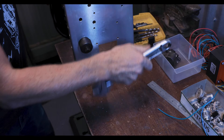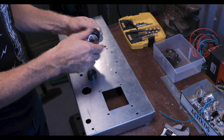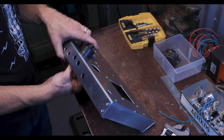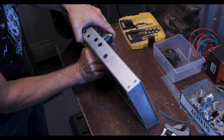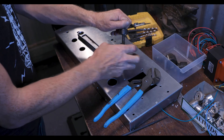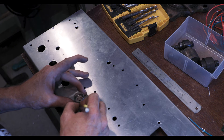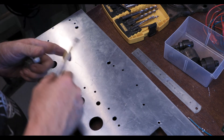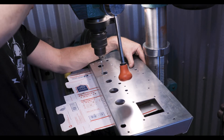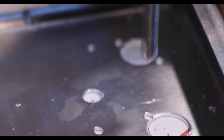I'll do my Greenlee chassis punches and punch out all those holes. I've got one for the preamp tubes, one for the power tubes, and one for the pilot light. Once I've made my holes for the tube sockets, I can take a tube socket, slide it into the hole, and line it up for the screw holes. Once all the tube socket holes are done, I make sure I get my holes in for the tag board that's going to be attached. Any tag board attachment holes, you want to put those in now so you're not doing it later after you've already started wiring everything up.